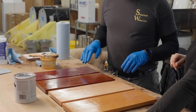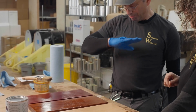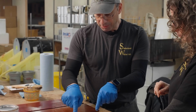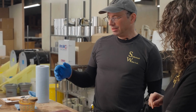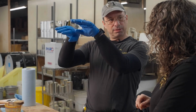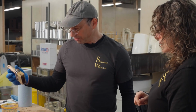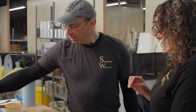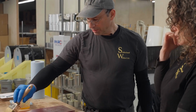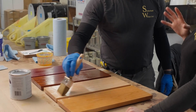Because now, it's almost like micro breaks. Yep. Just the wood isn't perfectly flat. Some of them you can get perfectly flat, but other woods, even microscopically, there's going to be some differences in the way things absorb and so forth. And so we would do 2 coats, and then you can move on to your top coat, Yep. or you can continue on with the hard sealer. Yeah. And the hard sealer is going to give you a satin sheen, right? Yep, semi-gloss satin sheen.